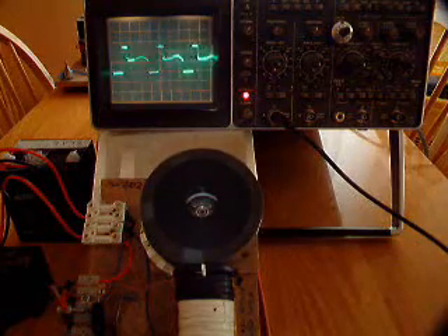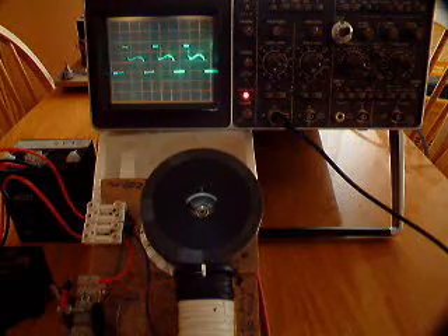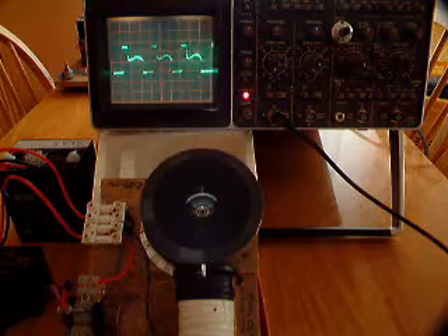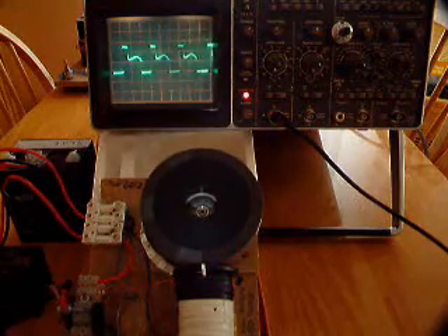This rotor will go up to around 2500 RPM, just into a single pulse. You can see that the on point of the transistor is just beyond TDC.